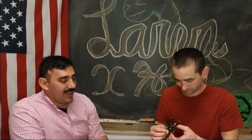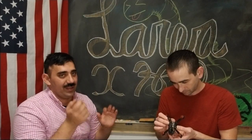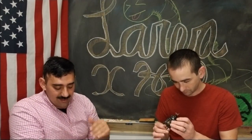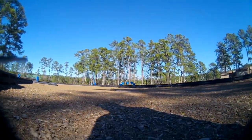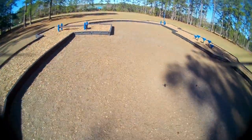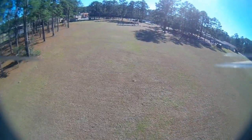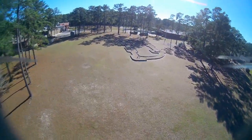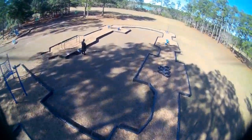Overall ease of use, I think it's great. I had an easy time setting it up for 3D using BL Heli and Betaflight — that's been pretty simple after a couple of times. The props are 2.5 inch press-on props with a 1.5 millimeter shaft, which is not super clear depending on your ability to read product descriptions. The Race Day Quads page has all that information if you scroll down far enough. I think it is super easy to control even in pretty tight areas.